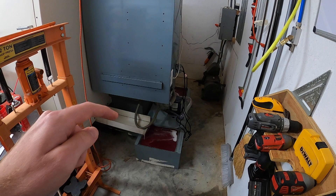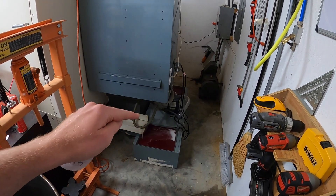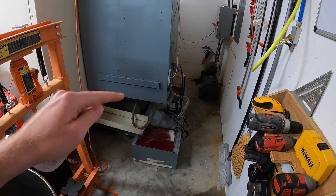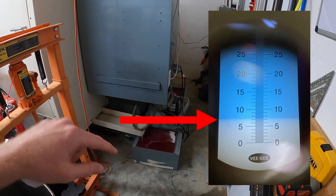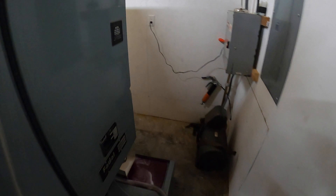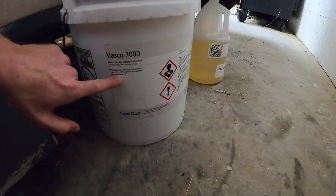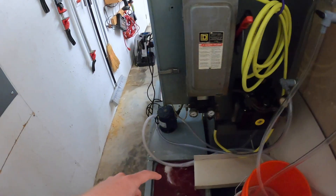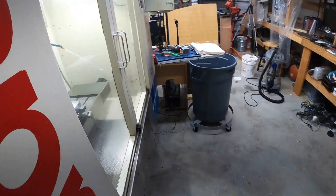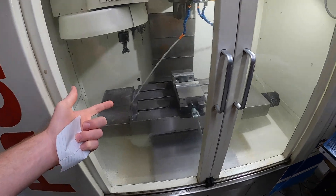Last thing was the concentration of my coolant. On the video I put 10%, and really on the refractometer I go to 7%, because on the coolant itself the refractometer factor is 1.4. So when you go to 7% on the refractometer, you get right at 10% actual concentration. And because I did all this — just to show you guys — I've got a nice clean machine, nice clean coolant, and everything is running.